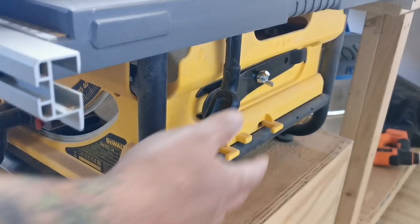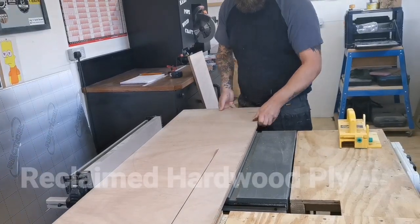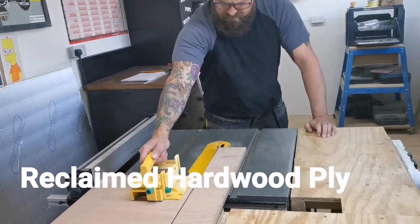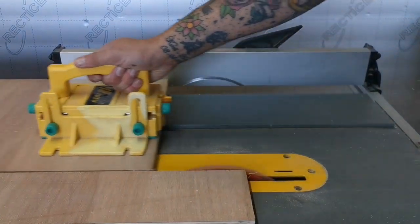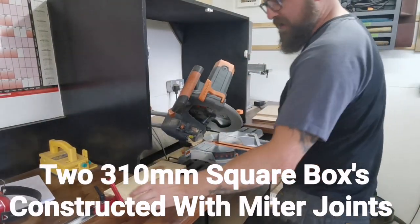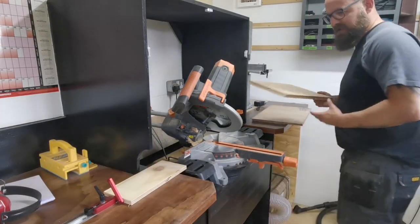We'll get on with the video. I'll show you some of the bits of timber we used prior to it looking nice and finished, and then we'll crack on with cutting everything down at the table saw to its final dimensions. To do these 45-degree bevel cuts I've set the dust hood off and set a stop block up, and we're just going to make the cuts — first one's done.